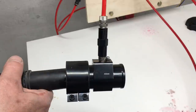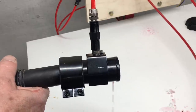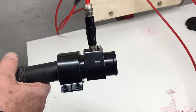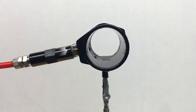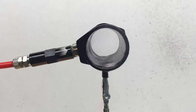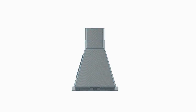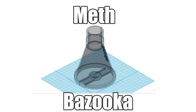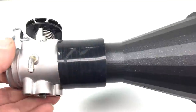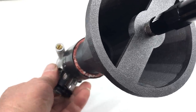Here I'm using a shop vac backwards — instead of sucking, it'll blow through a section of induction piping. Big flaw in the plan: when we sprayed the atomized meth into this tiny pipe, it immediately turned back into a liquid, and that ain't going to work. I guess we need something different to keep the meth atomized. What we got here is a meth bazooka. This project needs another thing to add to the already long list. The bazooka fits on the throttle body ahead of the supercharger and should keep the meth atomized as we inject it.